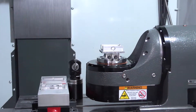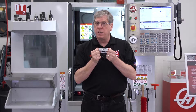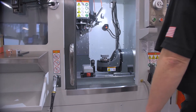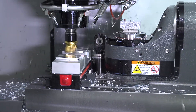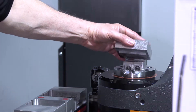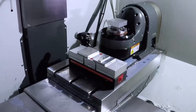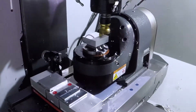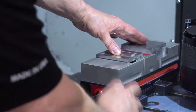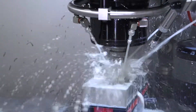We're going to show you how multi-axis machining techniques took this part from 4 setups to 2. The big advantage is that we only relocate this part once when machining finished features. Now I showed you how this was done in a 3-axis setup — let me show you how this is done in our 5-axis setup. I prepared the material because I'm using a dovetail fixture in my first operation. Cutting the dovetail shape and locating slot allows me to securely clamp the part using the least amount of material possible. I'm only cutting an eighth of an inch deep. The first operation is on the dovetail fixture on my 2-axis rotary table. Now I can cut features on 5 sides of this part. The last operation removes the dovetail and finishes features on the 6th side of the part.